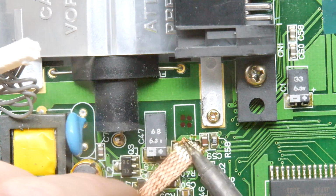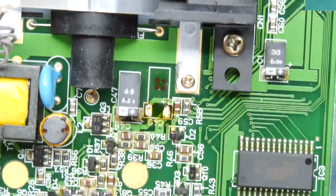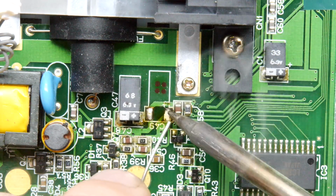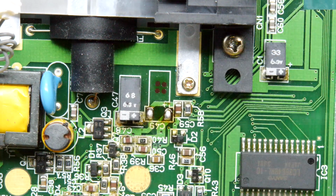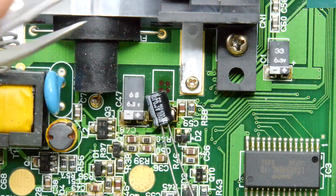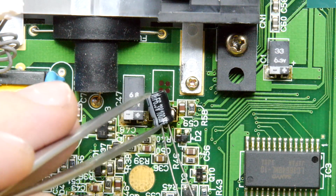Ouch, that's hot. I've got my soldering iron set to 360 degrees. That's probably why it's so hot. And I'm just going to do again, tap here, some fresh. We've got fresh, and this is unleaded solder. Just because we are funky and youthful, and we don't have things with lead in anymore.